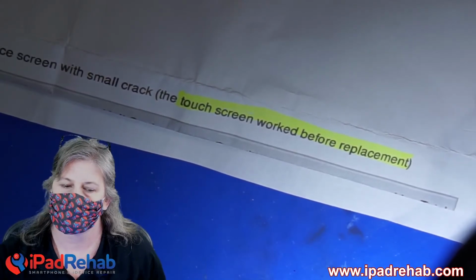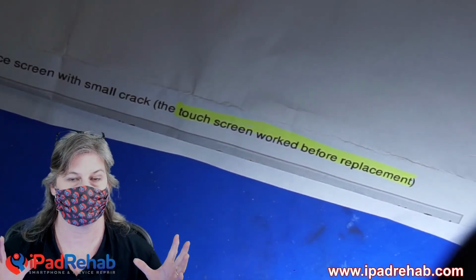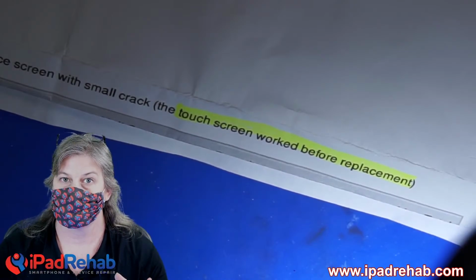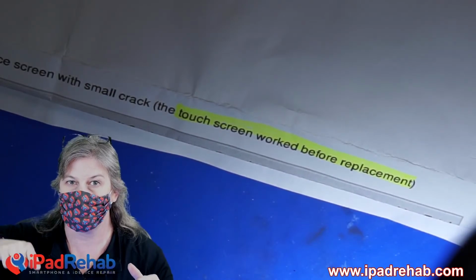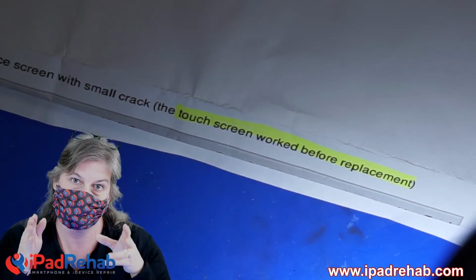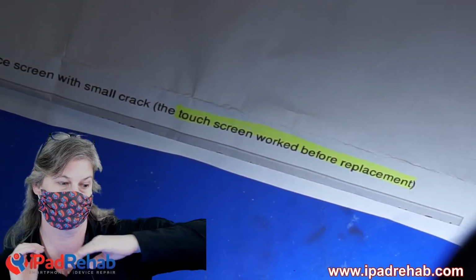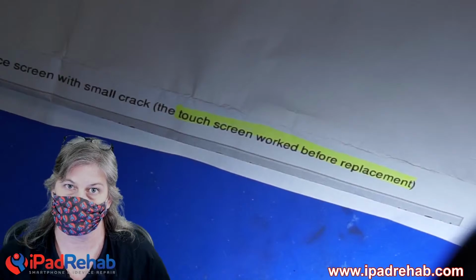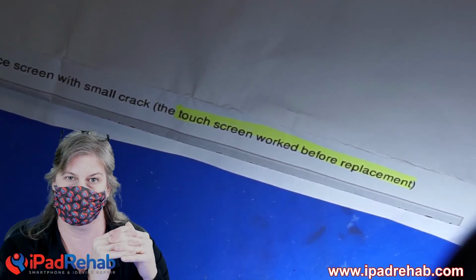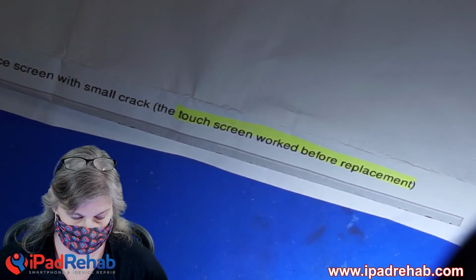But in my experience, my crystal ball says that the likely case is that this was a perfectly working, straight up cracked screen 6S, and that somebody plugged in the wrong screen, or the screen into the wrong connector. And that may have inadvertently electrocuted this line, electrocuting the CPU, causing a little tiny baby explosion inside the CPU, which is making that line touch ground. So that's the likely case here.